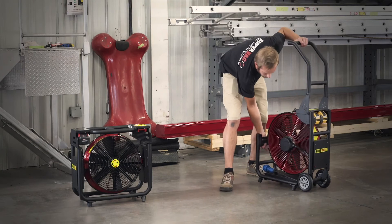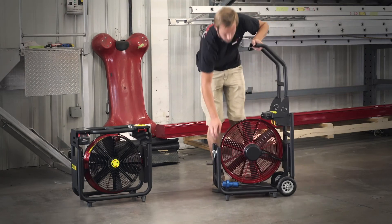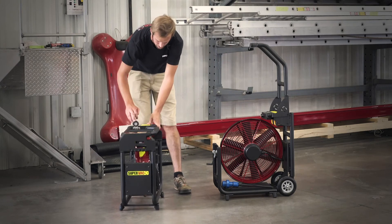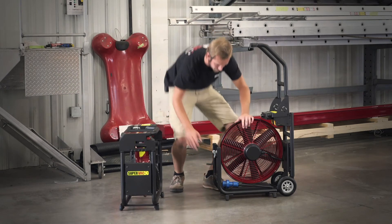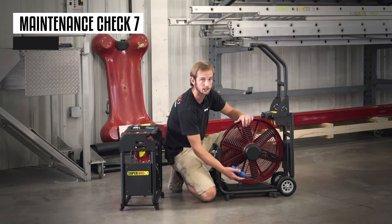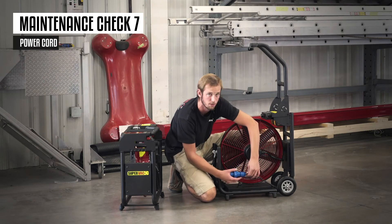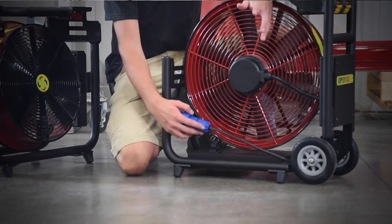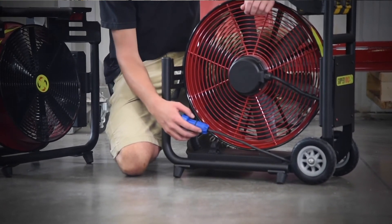Some of the shore power options that don't come with the U.S. standard plug style will have a cord. This cord should be checked regularly for any kind of damage, brittleness, or cracking. Replace that if there is any kind of cracking to prevent a shock hazard.